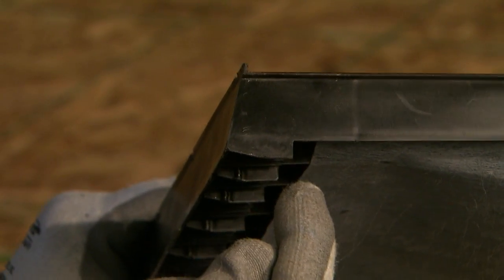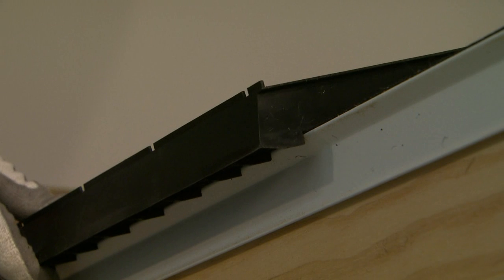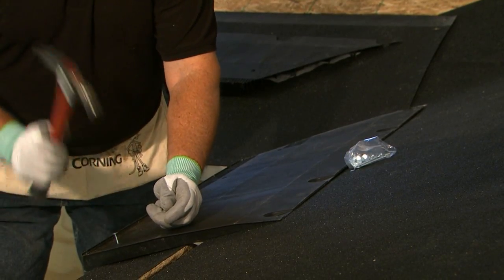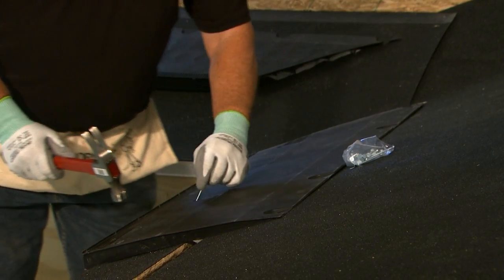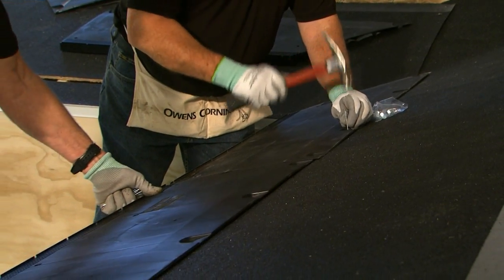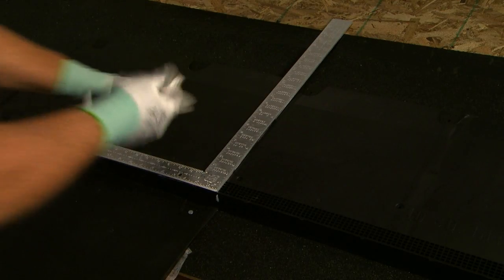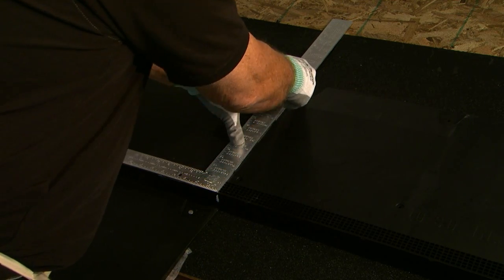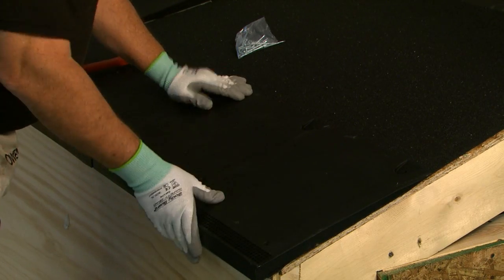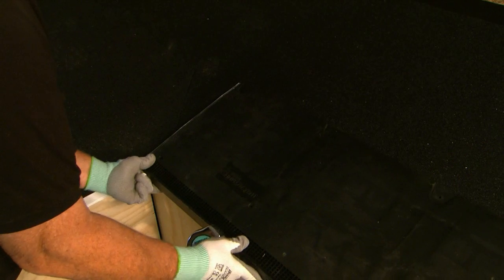There's an alignment notch near the air intake on each unit. Position the first vent flush with the rake edge with the alignment notch even with the eave edge. This will ensure the vent overhangs the eave edge by one inch, allowing air intake through the bottom of the inflow vent. Using the nails provided, hand nail the inflow vent in place using the built-in nail holes. Continue installing vents flush with each other from rake edge to rake edge. When installing the final vent, cut away the non-rake edge of the vent if necessary to ensure a factory finished edge is flush with the rake edge.